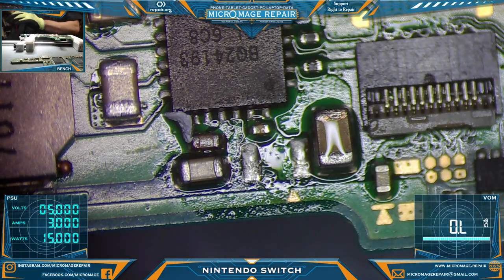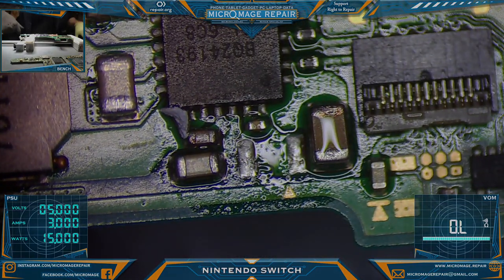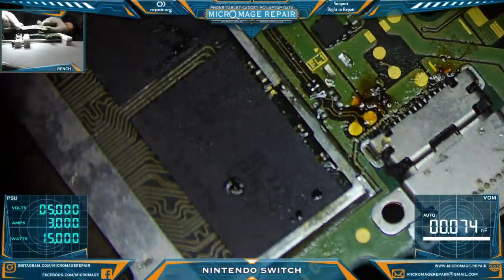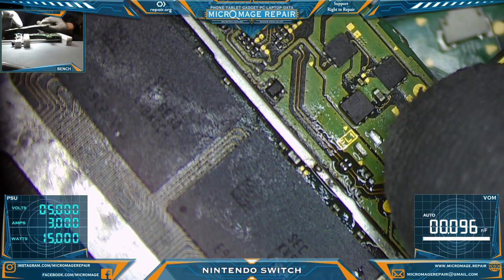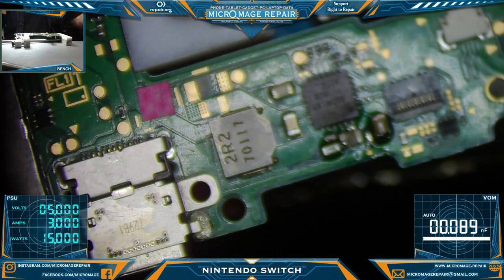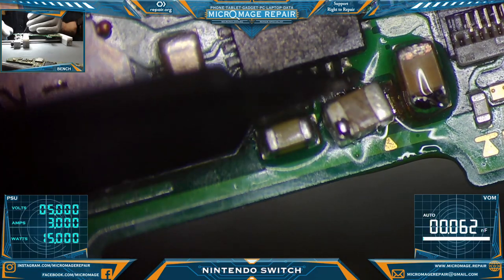Okay. Let me contact Jason and see if he knows what that cap is. I'm going to take a picture for him. And I'll be back. Okay, my buddy Jason at Jason's Electronic Repair, if you have not subscribed, you should, has come through. And he believes that this cap that was right up here by the MOSFETs is a fit, capacitance wise and higher voltage actually. So I have pulled it and I'm going to throw it on here because that cap was definitely short as we saw.